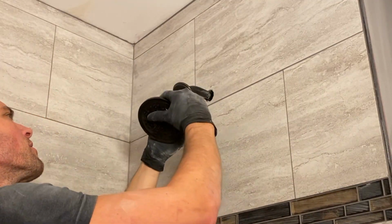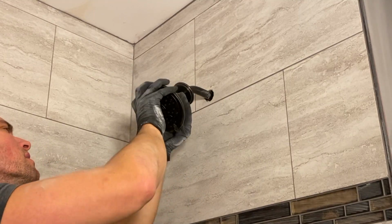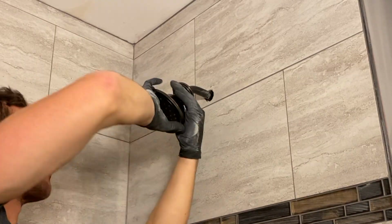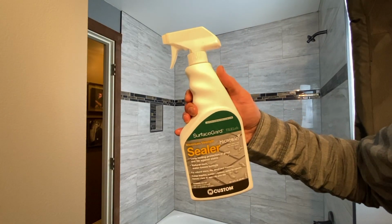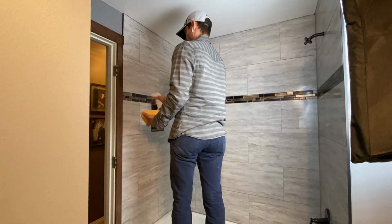As for the shower head, I remove the galvanized pipe, then install the shower arm, and then apply some seal tape and the head itself. Now I strongly suggest only hand tightening it or using a wrench very carefully, because at the end of the video you'll see a very entertaining outtake if you tighten too much.